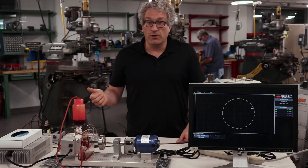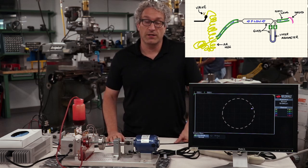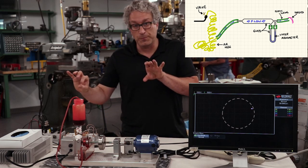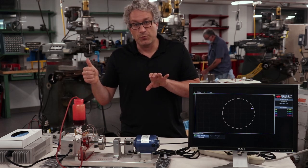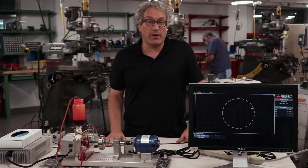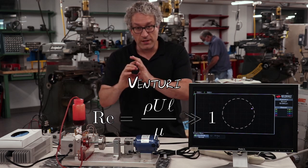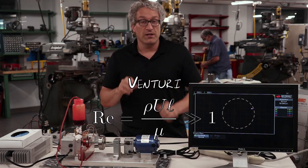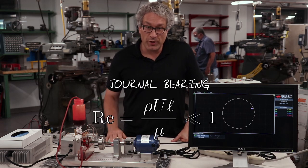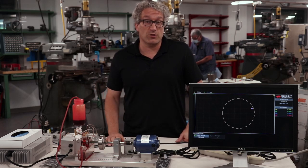You might compare this with another device that takes fluid and compresses it through a small cross-sectional area — for example, a venturi. In a venturi, we take a large tube and concentrate the flow down through a throat, and in that case the pressure goes down. In this case, the pressure goes up. The difference between these flows is dictated by the Reynolds number. In a high Reynolds number inviscid flow, as we compress fluid into a smaller cross-sectional area, it accelerates and the pressure decreases as described by the Bernoulli equation. Here, we're compressing lubricating oil through a narrow crevice, and the pressure goes up as described by the Stokes equations.